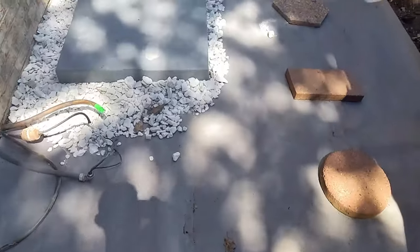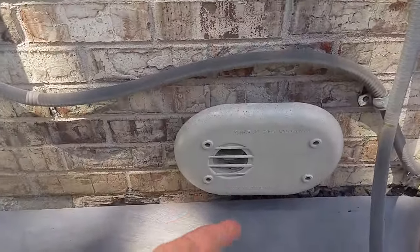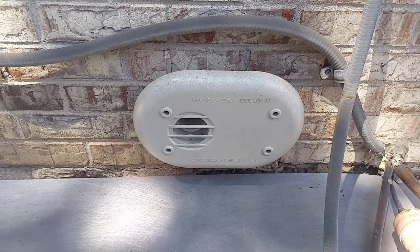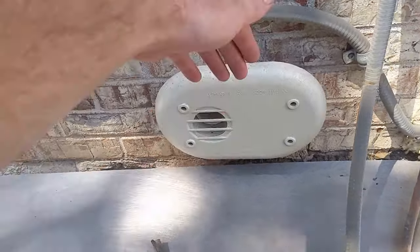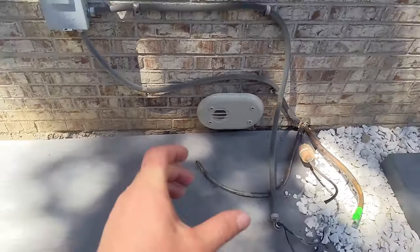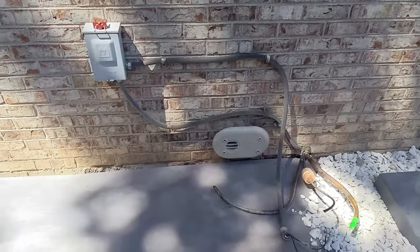This is just a fabric. I'm going to get a load of rock here once this is all done, and then there, this is a concentric air intake and exhaust. So exhaust's out the center, intake is out through the back, and that just really cleans it up so you don't have those pipes that come out of the house and candy cane back down.